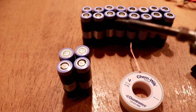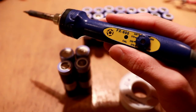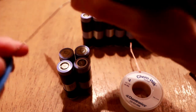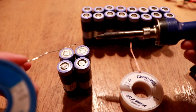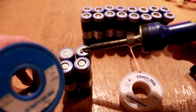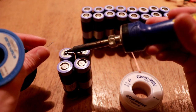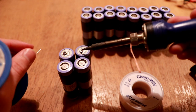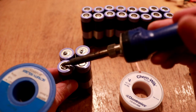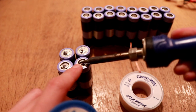Now I'll take the soldering iron and I'm going to be operating it between 400 and 450 degrees — hot enough to get heat quickly into the cells but not so hot that it immediately overtemperatures them. The trick to soldering to these cells is not using too much dwell time. You want to apply your solder, move it around a little bit, and when you see it start to collect and stick to the cell it's a good time to move on. You want it to wick onto the actual cell surface rather than form a ball shape.